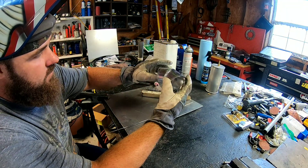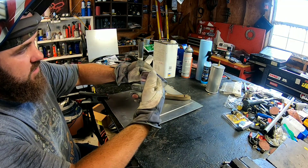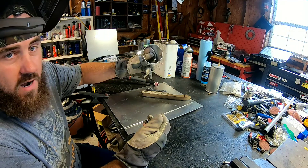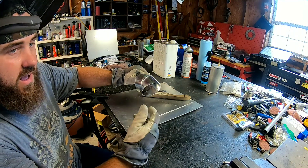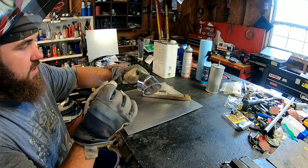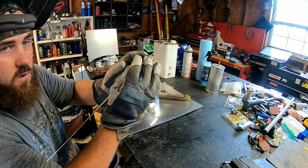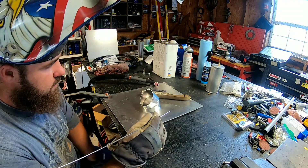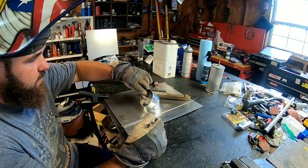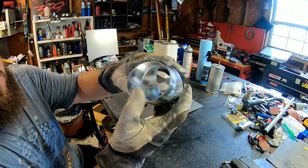The reason I'm not recording all of this is because this piece is so small that the heat has nowhere to go. This little weld is maybe an inch and a half, and the aluminum probably got to four or five hundred degrees. You weld about an inch to an inch and a half, then go hold it in front of a fan and let it cool down — because if it gets too hot when you dab your filler rod, it'll poke straight through and the tubing will just fold in.